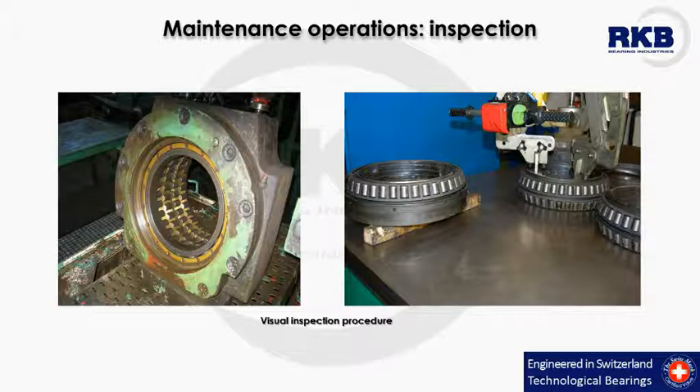After cleaning the roll neck bearing, the next step consists of performing the visual inspection of all raceways and rollers for visible damage. The best way to examine rollers is by rotating the cage or turning every roller. On most large bearing cones, the cages have one or two pins which are not welded in place and can be removed by prying out the locking wire and taking out the pin. In this way, the rollers can be dismounted in order to inspect the cone raceway or rolling surface.